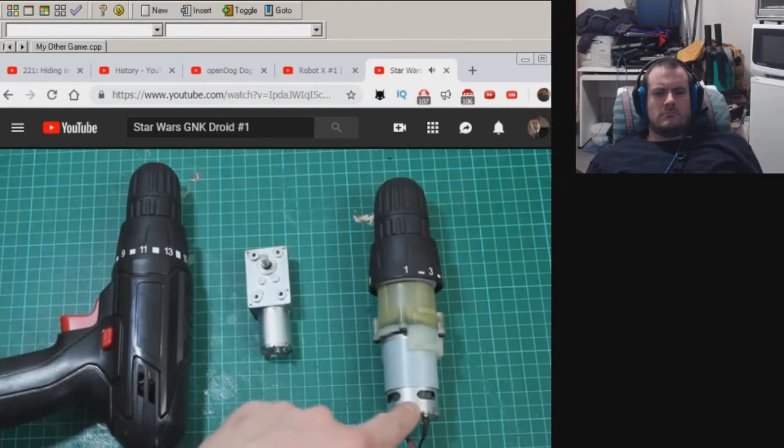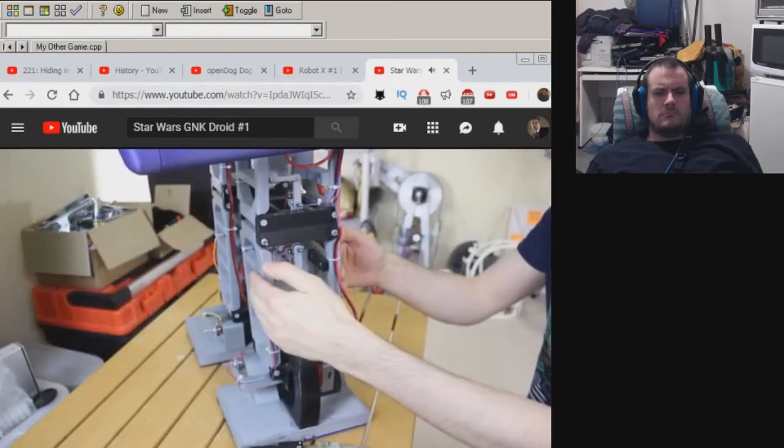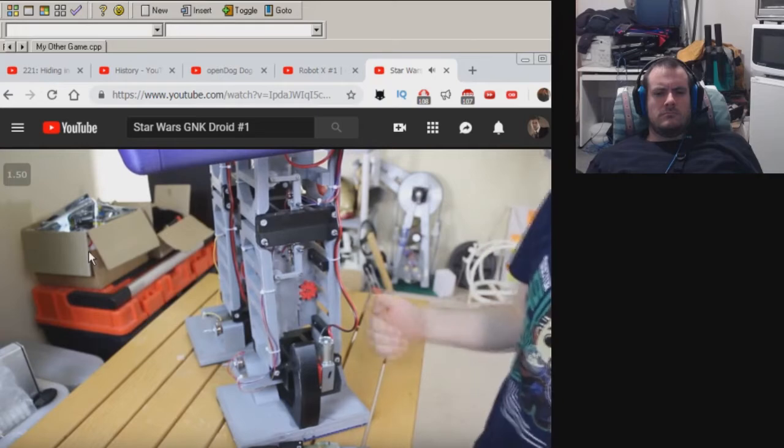There are brushless motors available to replace these. This is a 550 size motor. We can get a brushless equivalent to get much more power density if we have to. Obviously that has an impact on what controller we use, but there are lots of options for these. I also have a cunning plan to run these in pairs, so most of the force is going to be conveyed by 2 motors at once. So instead of having perpendicular axes, I'm going to have something that I'm calling a triangular axis, and we'll talk more about that in a moment. We're going to be keeping the parallelogram leg design because it works pretty well and it makes things a lot more simplistic.